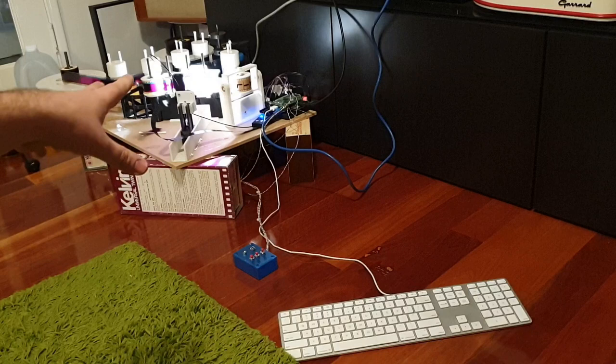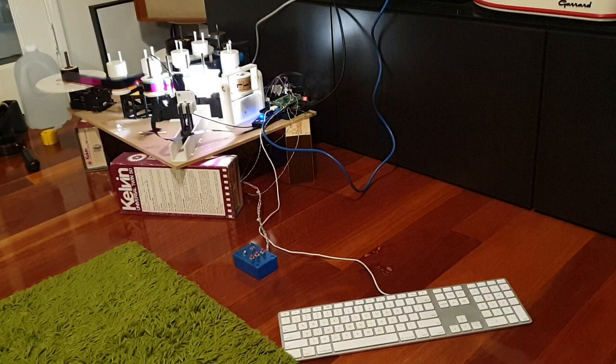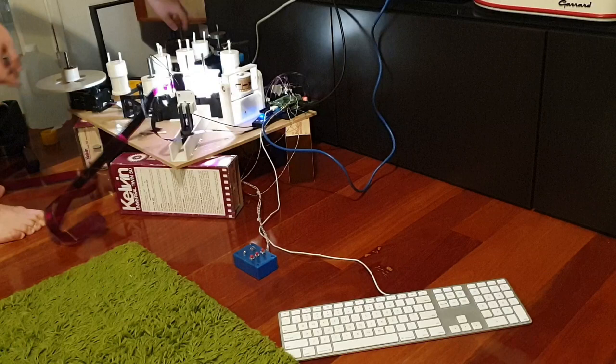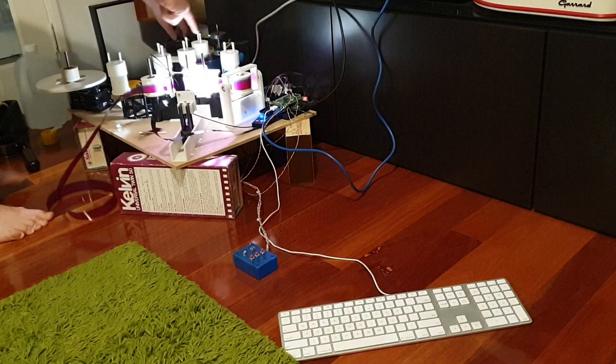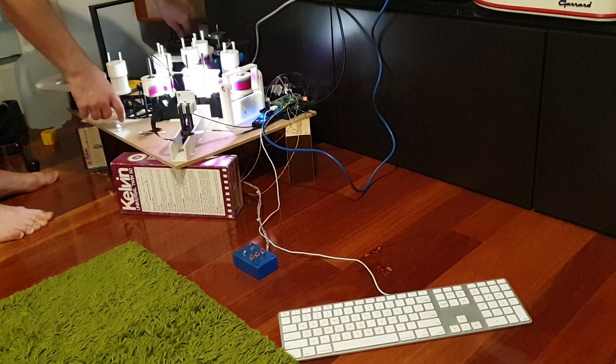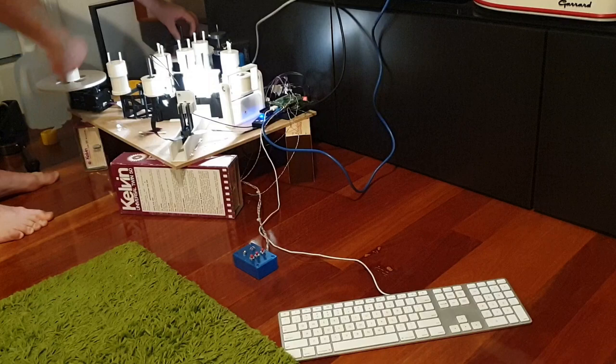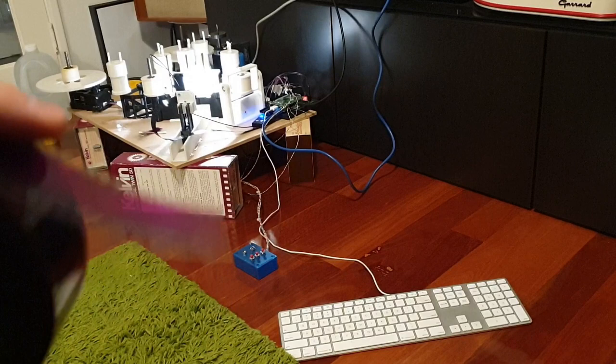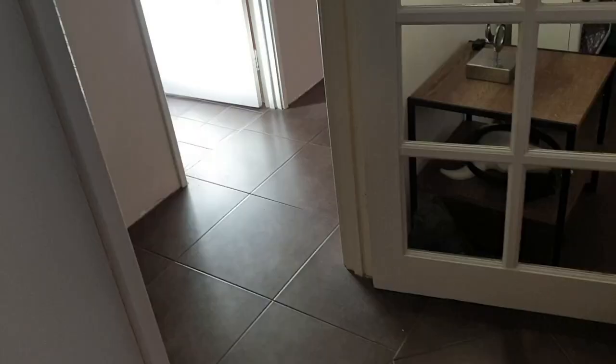This is probably the way the machine will be left when the reel is finished scanning, except for the fact that the tail would have come out. With that done, it should just be pulled through the machine. Because of the stops on the parts, there's no way to pull it out halfway through — it has to go through. And there we go. The film can then be removed, and we'll take that to the film room to remove the leader and the tail, because we need those for the next one.